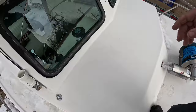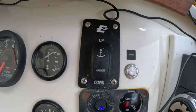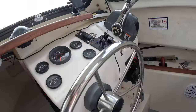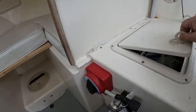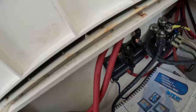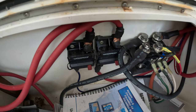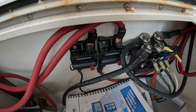So that's the outside. In here, very simple — look at that, up and down. It's got a picture of an anchor. Very simple. The operation of it is very simple. That is a control wire that goes to a relay that is under here. This relay basically has the power coming in and out and going up to there. The right-hand one is a 100-amp circuit breaker, which they recommend because the draw on this thing is rather large.